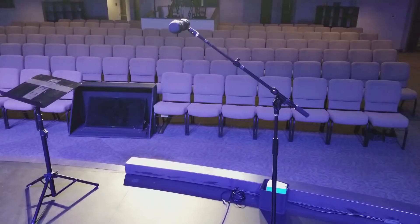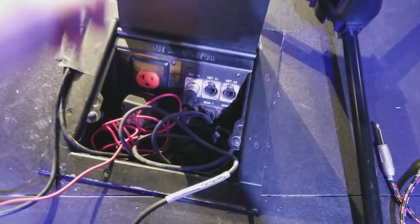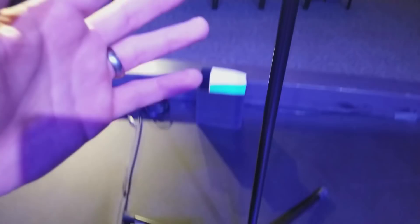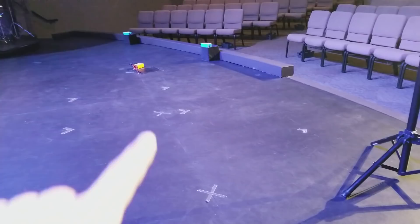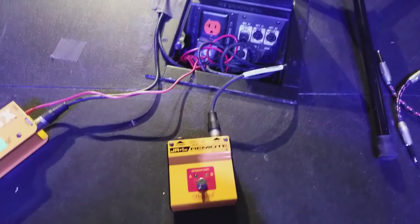So here we are out front. This is the remote switch I showed you in the office, and it's just plugged into our stage box — box A — going right into Mic A1. I'm using the existing cabling that's already run under the stage since I've got no wires on my mic stand and don't need those inputs, so I can actually use those inputs for my remotes. And if I wanted to switch to a different place on the stage, there are other boxes throughout. I can easily just run the remote to a different location and change the remote input on the Relay XO backstage.